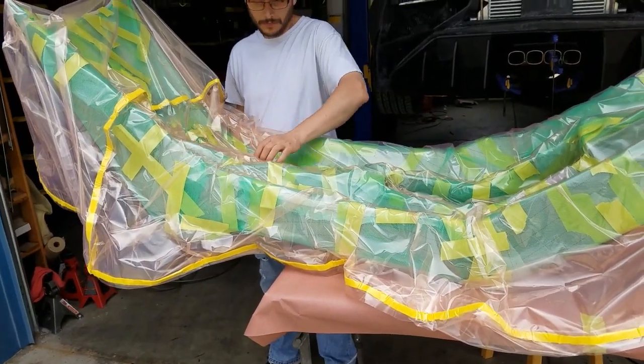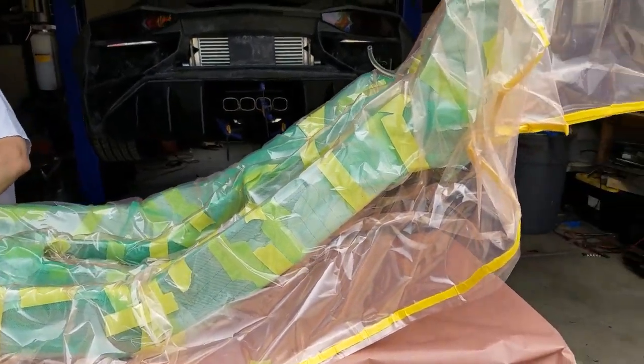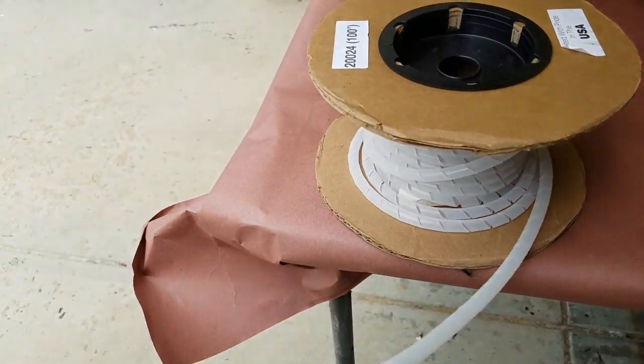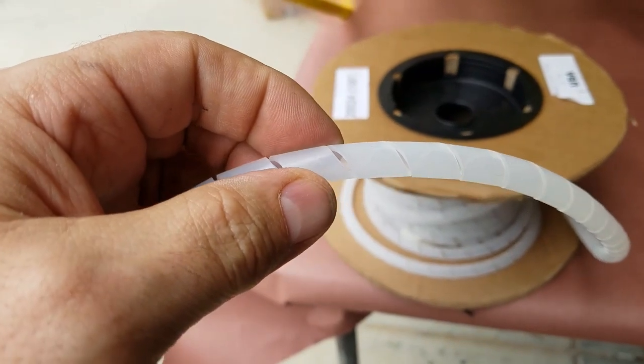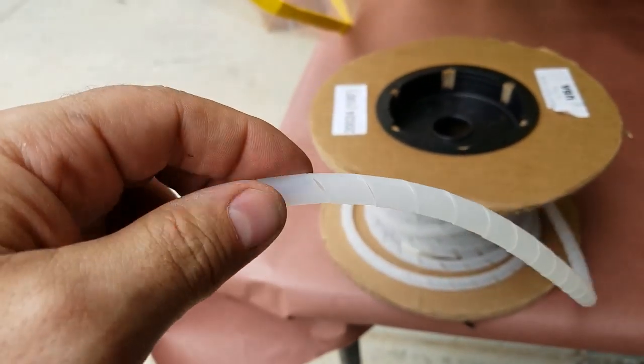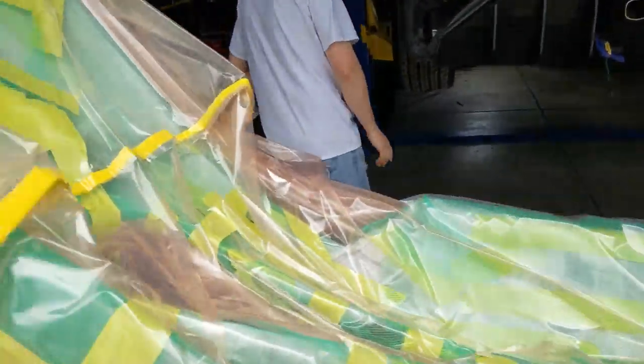One of the things you need to do is use this special tube that's cut in a spiral — that allows the epoxy to leak out all along the tube. You tape it to your part like this, then wrap in the 3/8 tubing and clamp it off. Make sure you clamp it off, otherwise you won't be able to pull a vacuum on your part.